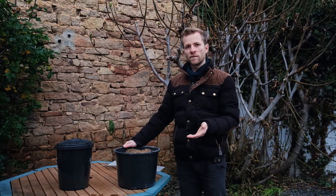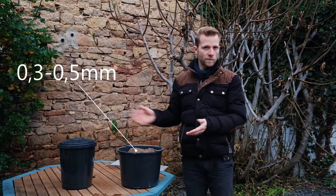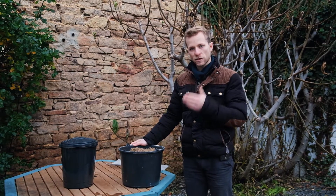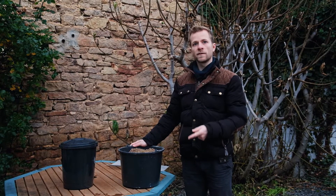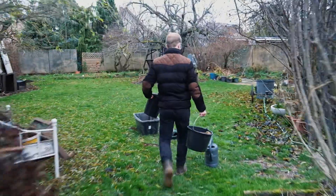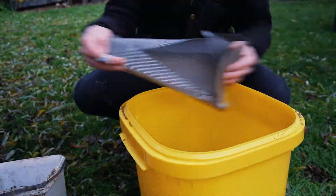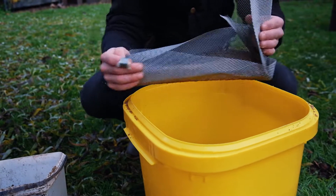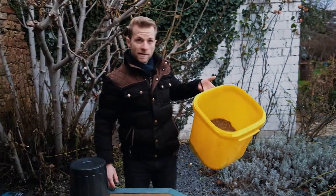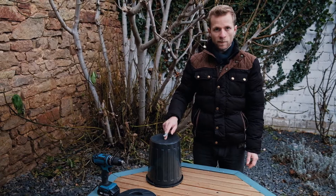In this biofilm, microorganisms help us to filter out bacteria or other microorganisms and break them down. For the sand filter to work properly, we do exactly the same steps that we did with the gravel: separate it from the too-big and too-fine particles. This sand that we have here was already cleaned from dust, so we only need to sift for larger grains. Once we have sifted the sand, we put holes in the bucket and add some fleece.